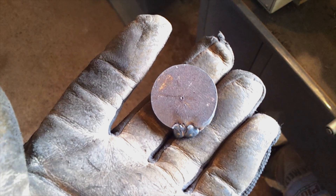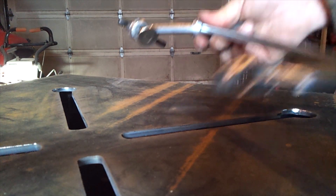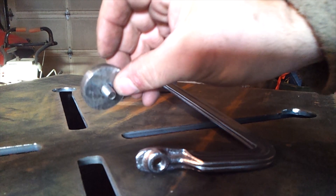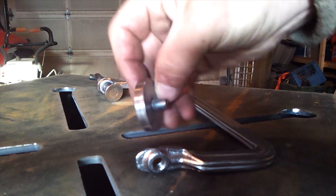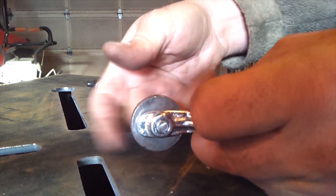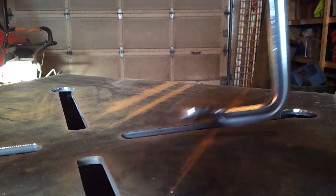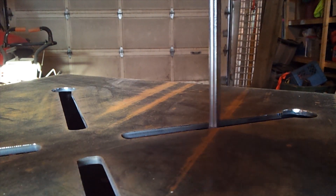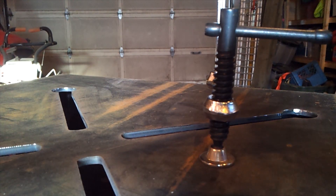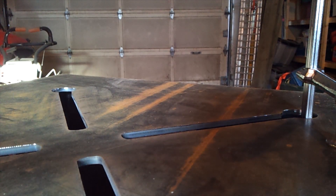So this is one of my offcut circles from earlier. I had to weld in part of the edge where the lead-in was in the wrong spot, but that's fine. I then went ahead and drilled a hole ready for mounting the stud. This is my strong hand clamp that I plan to use — I took a bolt that fits the thread and just welded that into the blank, and this will nicely screw onto the clamp, giving it a lot more support underneath. The idea is it will just go through that hole and slide onto the table. The width of the slot is wide enough for the clamp to turn 180 degrees in either direction, so I've got lots of clamping options.